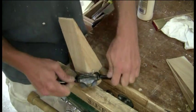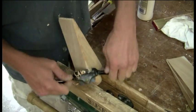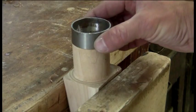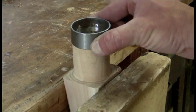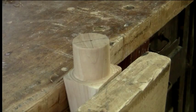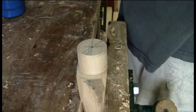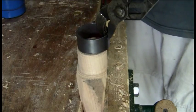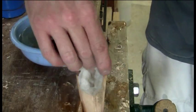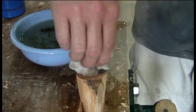It's not necessary but I'm taking the sharp corners off the edge with the spokeshave. Now as I mentioned before, the glut head is larger than the steel band, so to make it fit I'll heat and expand the band with a propane torch. With the band heated it easily drops over the glut head, then to shrink it back down to form a tight seal I'll just quench it with some cool water.